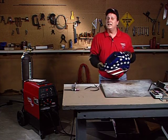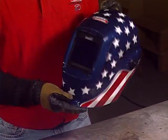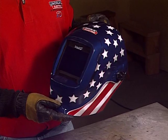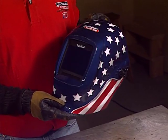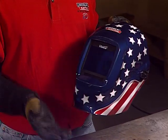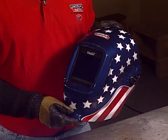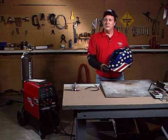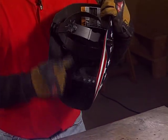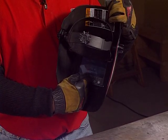You also want to protect your face and your eyes from the UV light — it's very bright light and very intense heat — so you want to make sure you wear a full-face helmet. This is a 4x6 welding helmet, auto-darkening, solar-powered with no batteries, and it has four sensors. It's adjustable from shade 9 through 13, because some people use a number 9, some use a number 10 — it all depends on the person. When you weld and then lift up your helmet, it's like someone took your picture with a flashbulb camera, so you want to darken the lens by pressing the buttons on the inside to adjust the darkness of the helmet.